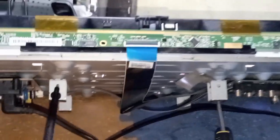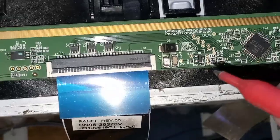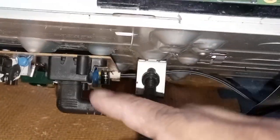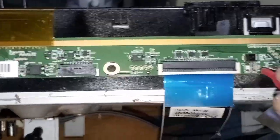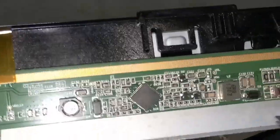As you can see, the top board of the TV screen is more visible and accessible now. Removing the front cover is the key. Now, measure the VCC — the 12 or 13 volts — to check if it is present. After checking the 13 volts VCC, let's check the three primary supplies: the VGH, VGL, and the 3.3 volts.